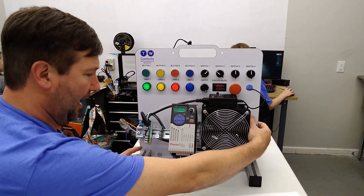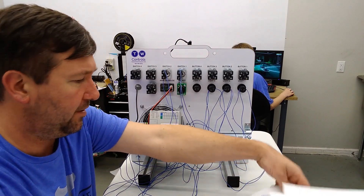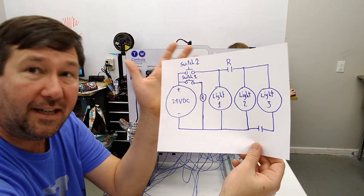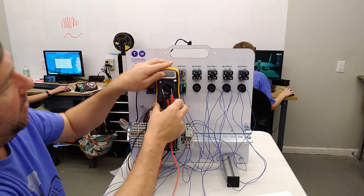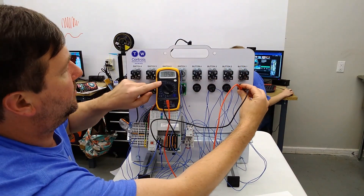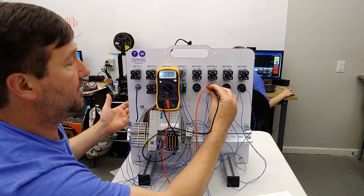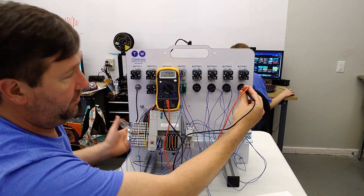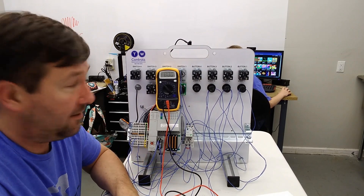So first let's flip this around and do a little recap. Right now our lights are in the series position. We have our voltmeter on volts DC, and when I check light one I'm showing 5.8 volts, light two 9.1, and light three is 8.9. Now when I flip my switch to make it parallel, we have 24 volts, 24 volts, and 24 volts — and that is what's making the difference in the intensity.